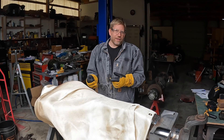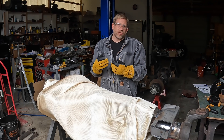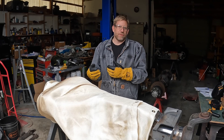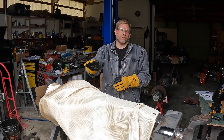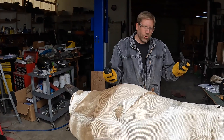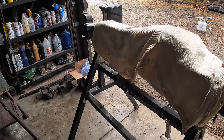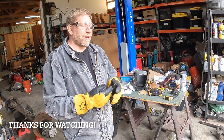We got out the weed burner again, reheated the casting back up to 400 degrees after we had finished all of the other welding. The reason for that is to help encourage the new metal and the casting to cool together at the same rate, which is all about trying to relieve stress and avoid stresses being built up between the casting and the new metal. Once it's all hot, we wrapped it up in the welding blankets. The idea is to hold the heat in and slow the cooling process as best we can. Some folks will go bury the axle in the kid's sandbox for the same purpose. At this point, we set it aside because there's nothing else for us to do until it's cooled down. We want to give it as much time as possible, let it come back to essentially room temperature, and then we can continue working on the axle.